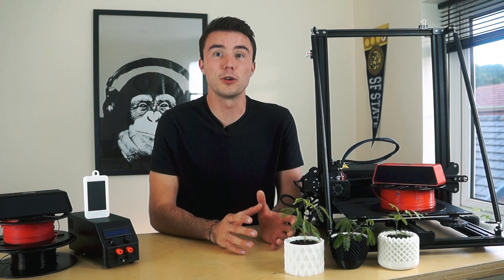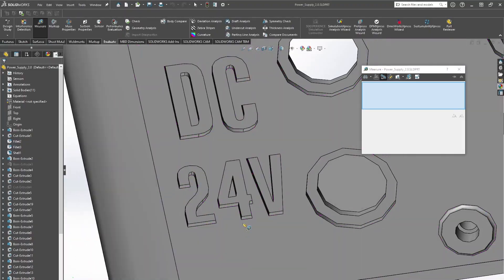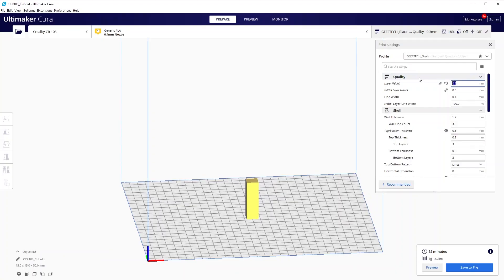When doing text, you want to make sure that the smallest parts of your lettering are ideally no smaller than twice the diameter of your nozzle. On the Z axis or vertical axis, you have the potential for greater detail as you can go down to layer heights less than 0.1 millimeters. This will increase the length of your prints, but knowing the level of detail you're using is key when deciding which layer height to use.